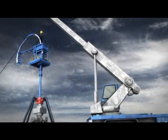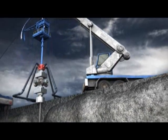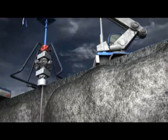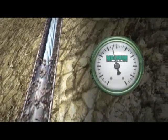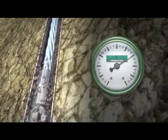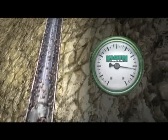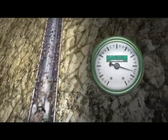After all stage work has been completed, the plug drill-out process will begin. Depending on the operator's preference, this can be accomplished with a coiled tubing unit, drilling motor, and tricone drill bit, or a workover rig, tubing, power swivel, and a tricone drill bit. Slowly run in hole until a pressure increase is seen — that is plus or minus 90% of the motor's full load differential pressure rating. This should put the milling assembly in near optimum milling conditions.